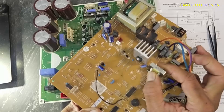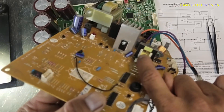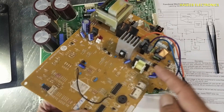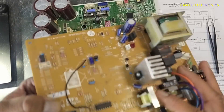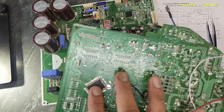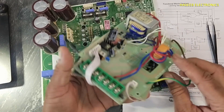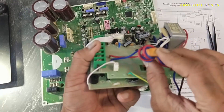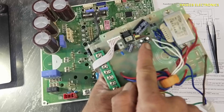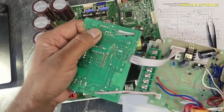The detailed parameters are covered here in this chapter. Its function and role is similar to this transformer. In this board, one wire AC input line is passed through this window — this CT, current transducer or current transformer. How much current the outdoor unit compressor draws, it will tap voltage in the secondary winding. These voltages are then passed to the other side, rectified, and passed to the microcontroller. The microcontroller will understand how much current is flowing, and in an over-current condition it will cut the drive.